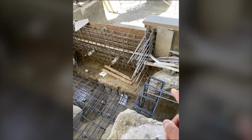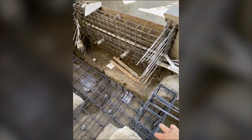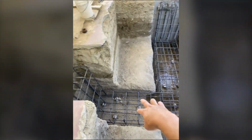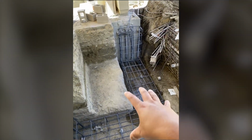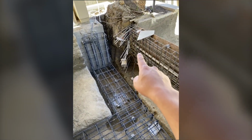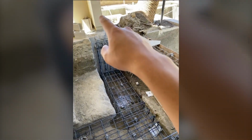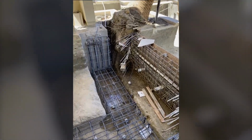So they finished tying the rebar yesterday. This is tied to the house, goes down, goes all the way across, comes back up. Here it goes down under, comes back up. After we pour concrete, then the spa goes on top of it. That's part of the other side of the wall, the spa. So by doing this, we tie this together so the house and spa move together.